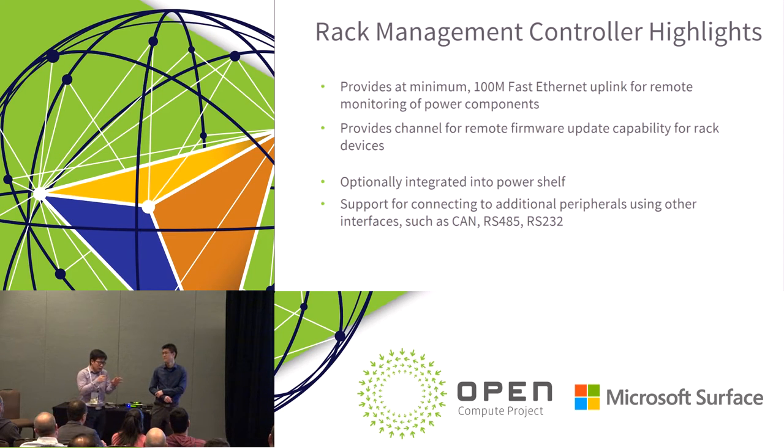Basically, in the connectors on the IT tray, there's one pin called the short pin. When you remove the tray, you have a signal that you can send to your downstream VRs, with a delay of milliseconds. Then you can start to cut off your load after you receive that signal. So when you really remove the connection from the bus bar, you don't have any load by the time you remove it. It's a very smart way to do that, and it has been introduced in the specification. Okay, it's a very good question.